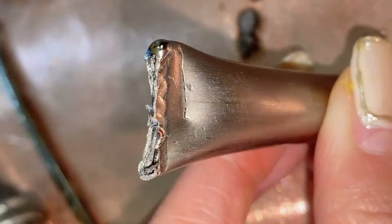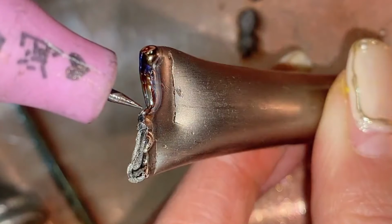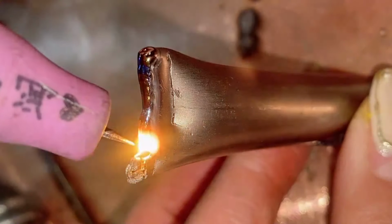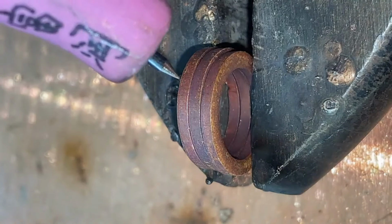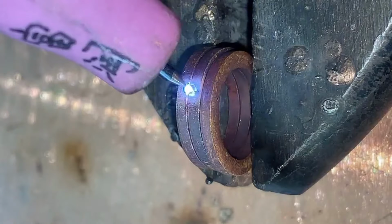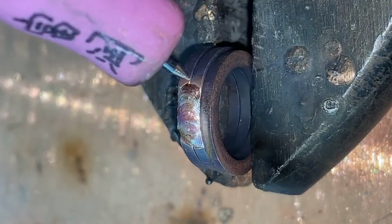The second is the difference in the amount of deformation. Thin plate welding is not easy to deform. The welding temperature is much lower than that of the argon arc welding machine. The cold welding machine has great advantages over the argon arc welding machine in the welding of thin plates. The welding deformation of the thin plate is very small, and the thinnest manual welding can reach 0.2 mm. Compared with TIG welding machine, cold welding machine is not easy to burn through.